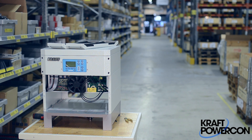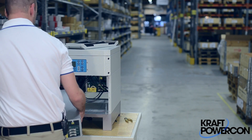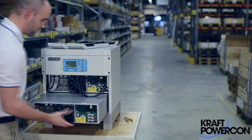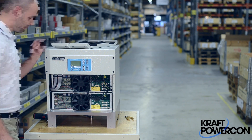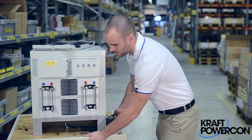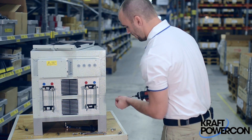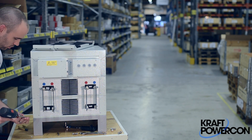We're going to grab a new one. We've got a new module. There's a little lip on the bottom level; I'm going to put the corner of the module here. Make sure you're careful with the cables — they look fine. You want to slide the module in evenly. If you get stuck, just back it up a little bit. It's already in place. We'll go and connect the back part first. We'll start with the screws — we're going to reverse the entire process. Fasten them so the screws aren't going to spin; make sure it's nice and secure. You don't want to break the screws.